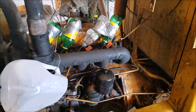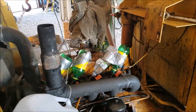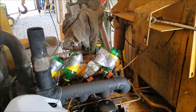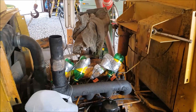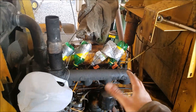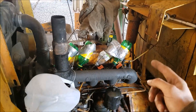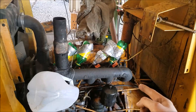At this point we're going to pull the valve cover off, turn the engine over, and get a good look at all of the valve train to make sure everything's at least opening. I'm assuming the valve train will be okay and we'll be pulling the head off. Either we've got a burnt valve or something, but seeing zero on the compression test is pretty significant - I've only seen that one other time.